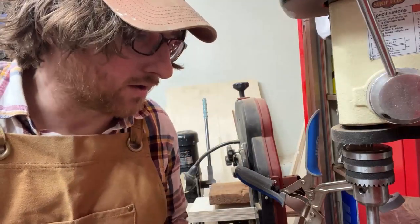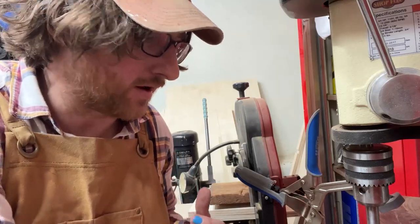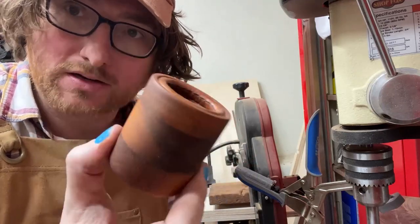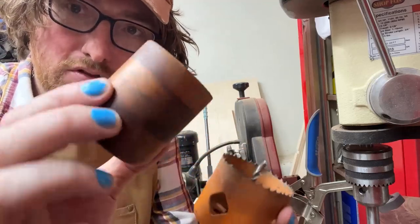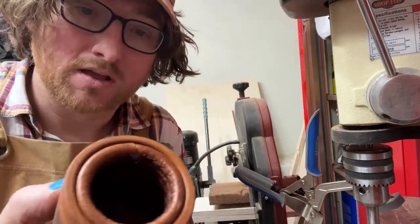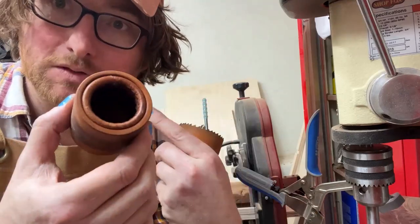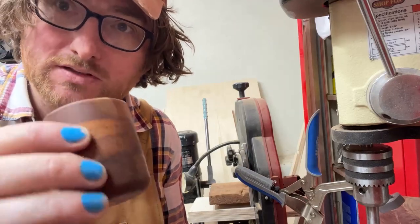Okay, I'm over at the drill press, which in my disorganization means I have to kneel on the floor, so that's definitely not safe. I don't have a lathe, so to make the dice cups, what I did last time, what I'm going to do again, is use a hole saw to cut out three rounds from sort of inch thick material, and then glue them together. And then I'm going to use a Forstner bit to drill out the middle. So that's a slightly guerrilla way of doing the same thing.